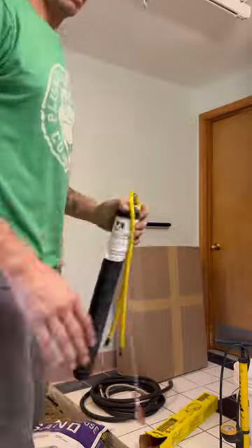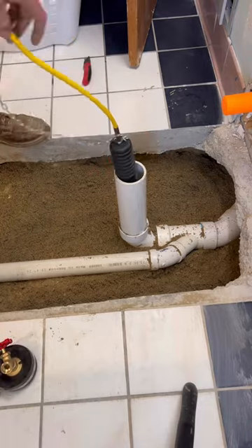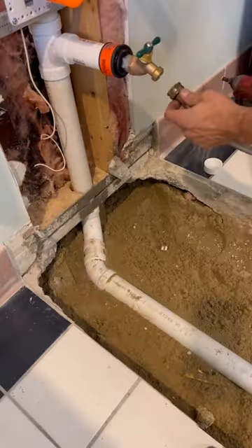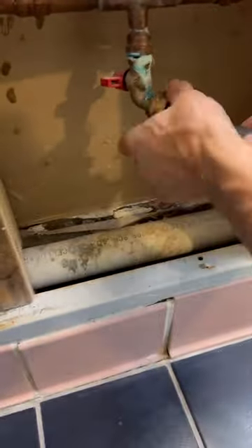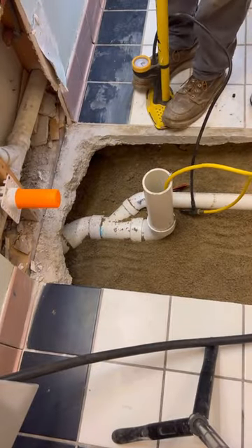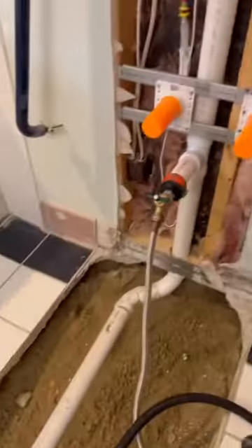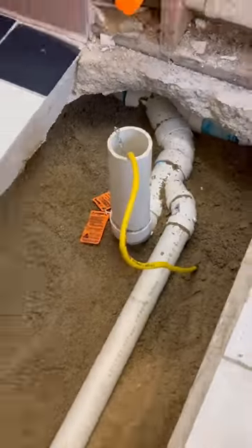For everybody with something rude to say in the comments, I got one of these for you — just send me your address and I'll mail it. A lot of plumbers don't even know what you do with it: you shove it down the pipe. You put a plug on it and fill from there — even though it's dripping green stuff, it did the trick. You pump that long dong up and it cuts off that two-inch line so you can fill the drain line up through the vent.